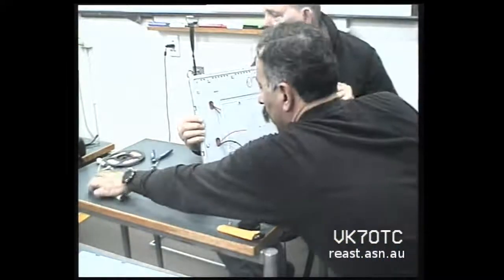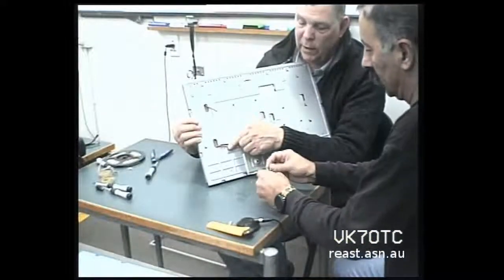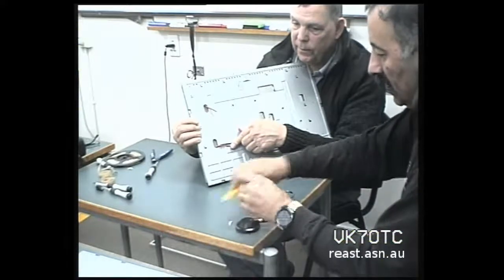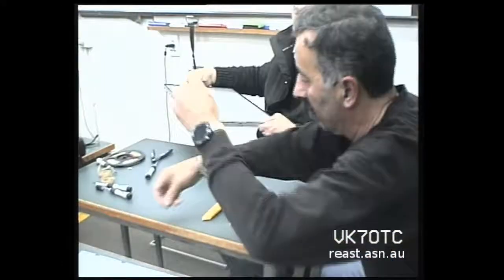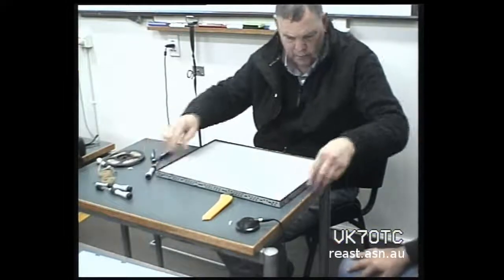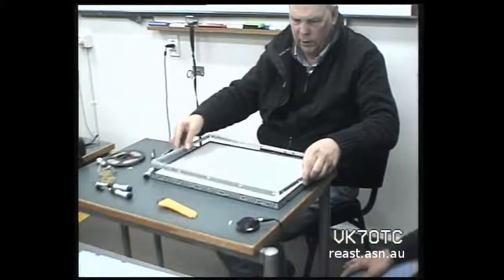Oh, that silver tape, did you save it or did you ball it up and throw it away? It's down in here. Just slap a little bit of that on, like 100 volts, I reckon. Just rip it in half. It would have to be some sort of pulse because you've got to get it to strike. The power supply is probably a shaped power supply. When you switch it on, it gives this high pulse to get it to strike, and then it drops down to running voltages.